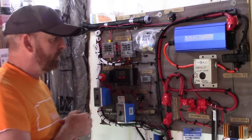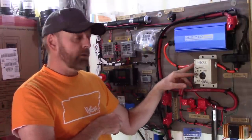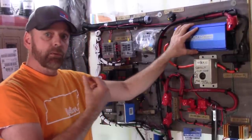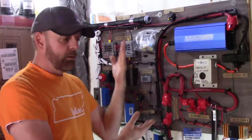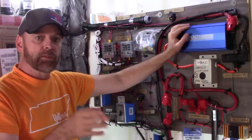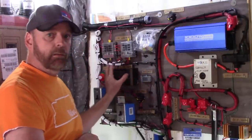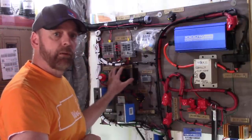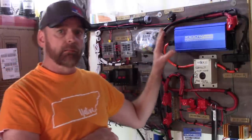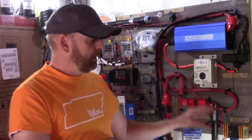I call this my DC side and that's my AC side. I want to highlight two components. This is a battery cutoff from Missouri Wind and Solar — it will cut off the circuit driving the inverter to the freezer if voltage hits 12.3 volts. The internet engineers will say you could use a battery management system for this, and they're right. But I'm not going to spend that money. The charge controller handles float charge, desulfation, and everything else I need.